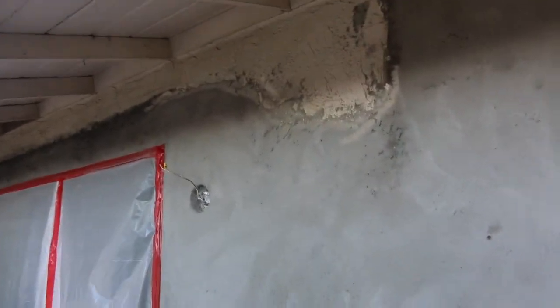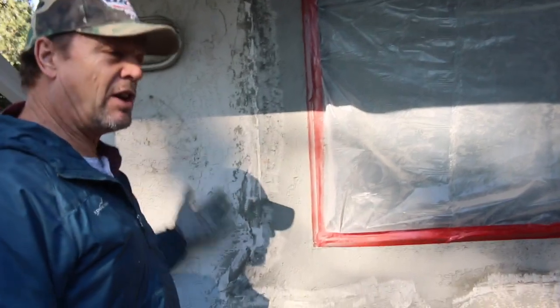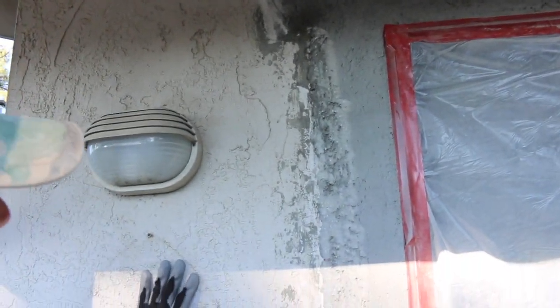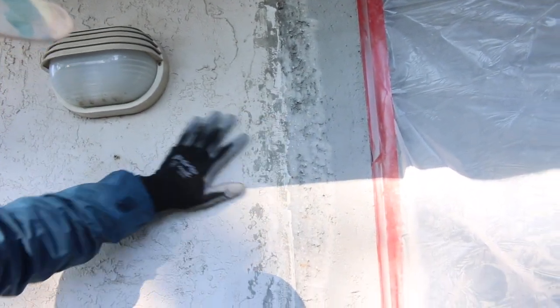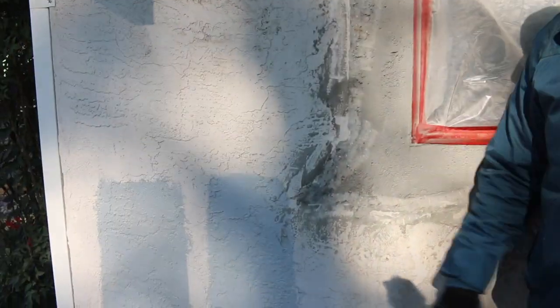What we've done is we just picked up some medium stucco today, and we're going to be able to blend this area over here where it looks like it's got fine material, so it's going to be all one uniform texture and blend with the existing coarse material. Around this window, this is where the art comes in folks — the wall's been painted so many times. You can look at the wall and say they used coarse sand here, but since it's been painted so many times, if you back your sand down a little bit, maybe go with some 20-30, it's going to look just like the existing. So that's what we're doing — we've got some medium here, and since they did go with coarse originally, we're backing it down one step.